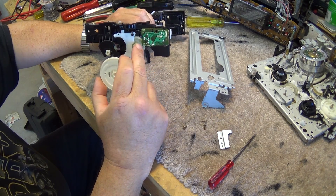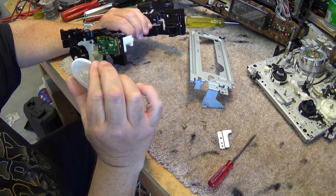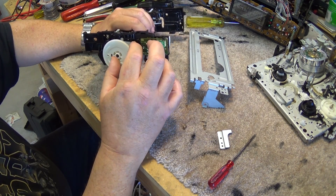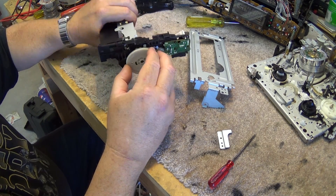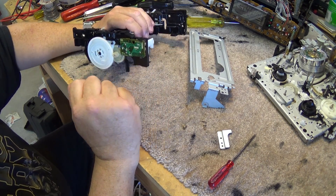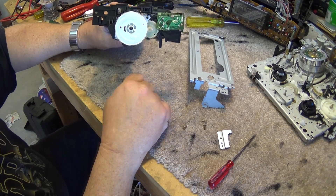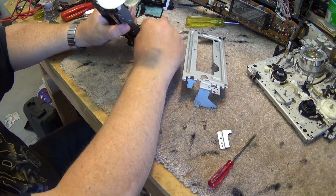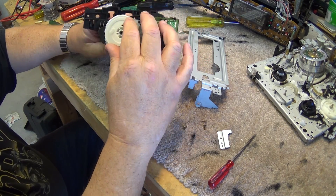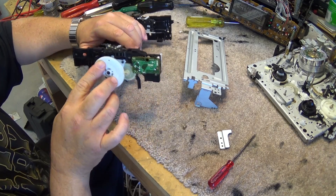This one is just an idler gear, an intermediate gear. When we're lined up, everything will drop in place. We can see the last tooth of this loading cam gear is lining up with the main loading gear on the assembly, and we'll be able to run it through its motions. If you're out of alignment it won't work. That's basically this portion of the mechanism.